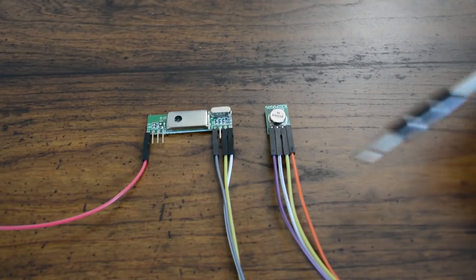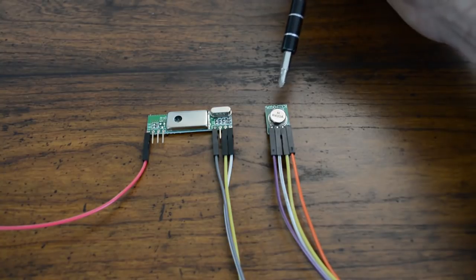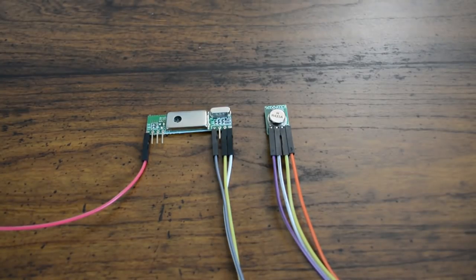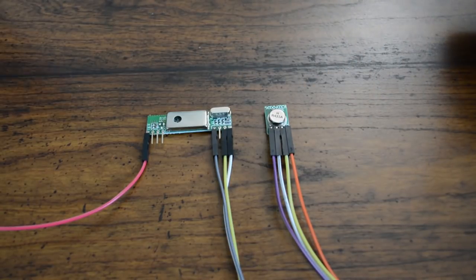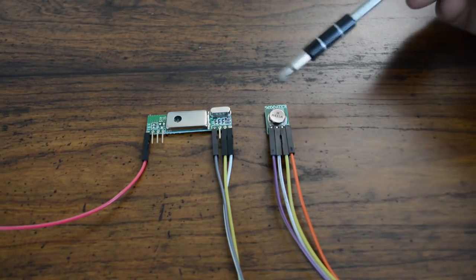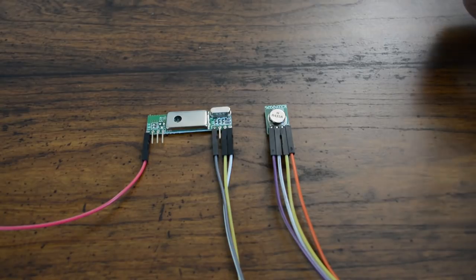First, you'll need to acquire a few female-to-female header wires and a 433 MHz RF transmitter and receiver. I prefer using the slightly more expensive Super Heterodyne RF variety, as their performance is much better than their cheaper generic RF counterparts. You should be able to get a transmitter and receiver set for about $10. Links for these will be in the description below.